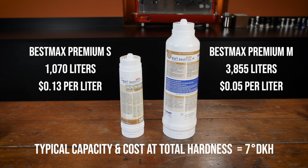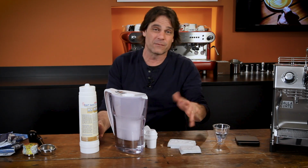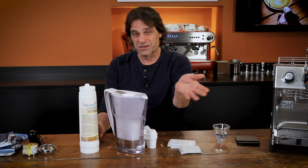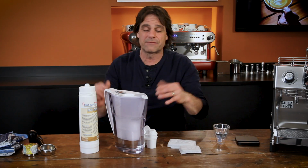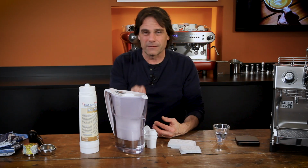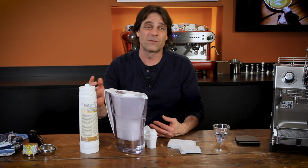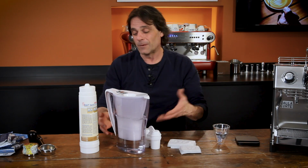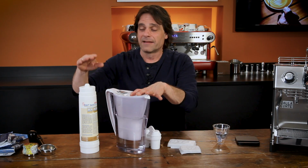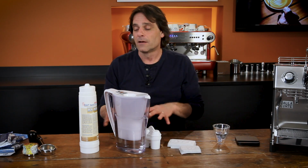And again, what is really nice about it, they're the only company that has this calcium to magnesium. You know, the other ways you can do water softening is replacing with sodium, which is going to increase the sodium level in your water. Then there's polyphosphate type systems, which can bind with minerals in the water. Those don't work when you get into really hard water areas. So really, in our opinion, this is the way to go. It's worry-free, again, used properly, no scale.